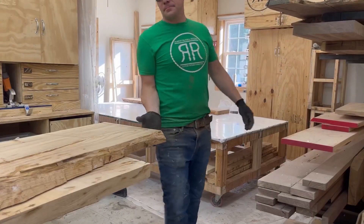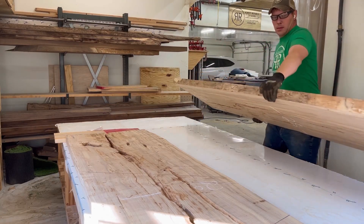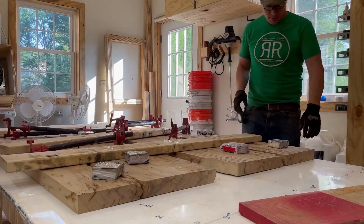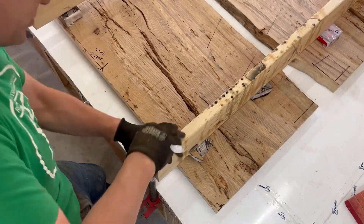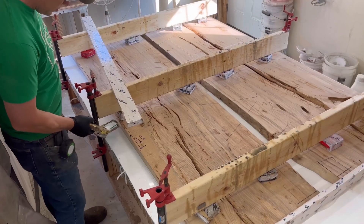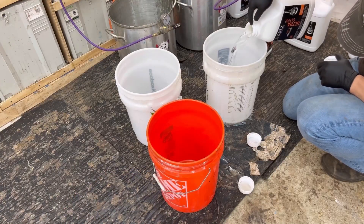I use silicone spray to make sure the HDPE doesn't wear out from repeated pours. Setting up the slabs for the first pour, I put blocks there to easily clamp down the slabs so they don't float when I pour the epoxy — clamping them down nice and tight, which also keeps them straight if there's any bow or warping. Then I dam up the edges and caulk the seams to make sure it doesn't leak.